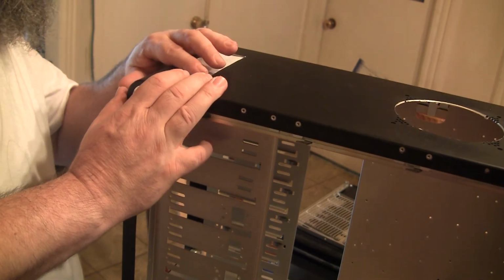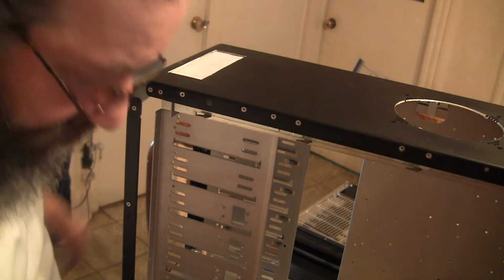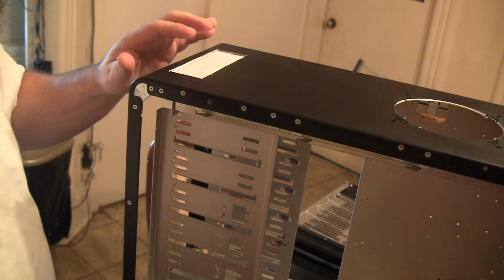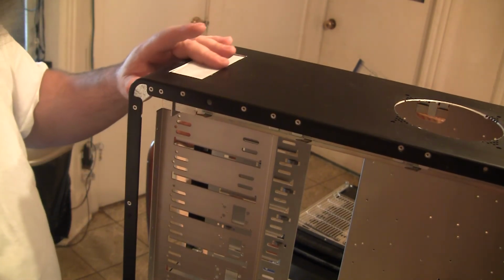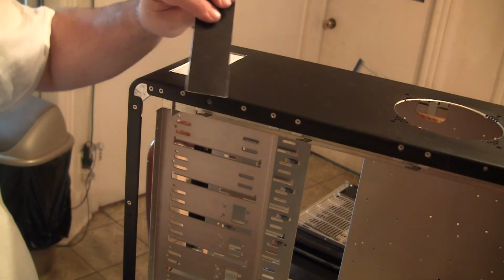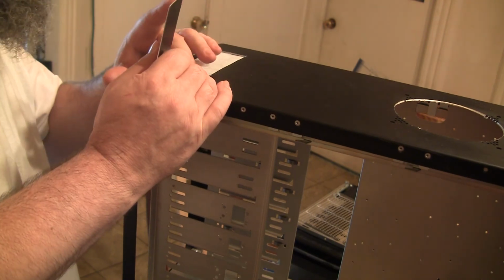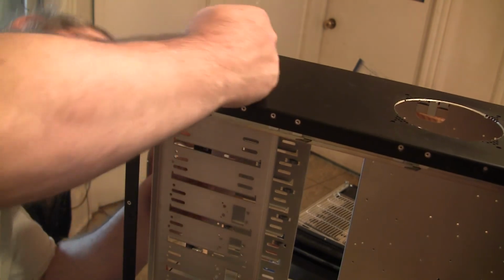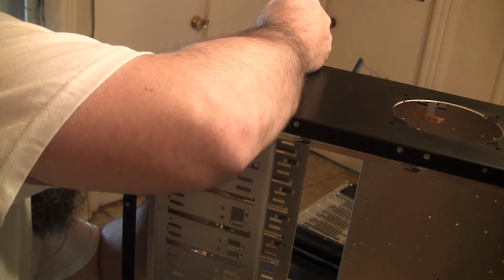So right now I'm just making sure that the wax paper is completely covering this hole here, because this piece is going to go in here, and once I start putting in the JB Weld, I don't want it to start oozing down and dripping and so forth. The wax paper was there to keep it from sticking to the plastic pieces that are actually giving the support to hold this in place while the JB Weld dries. You can make it a little bit bigger, but you have to make sure you have enough room for the tape to stick. If not, then it's not going to hold.